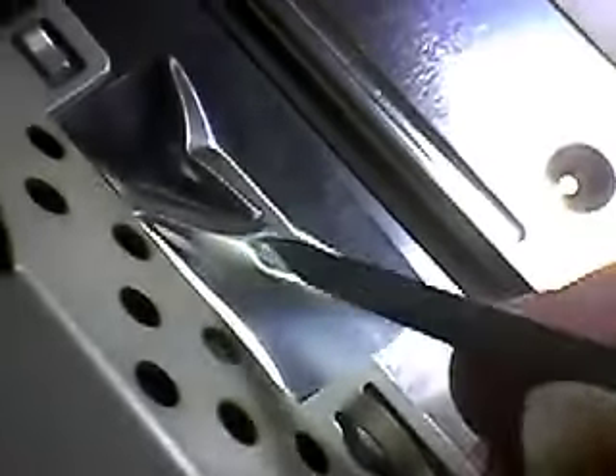It's another fiddly job. I have to squeeze these clips on each side and then gently pull until we get the clip out. There's one unclipped — and the other one. Actually there's no clip there but it's taped on, so you pull like that. The side cover comes straight off.